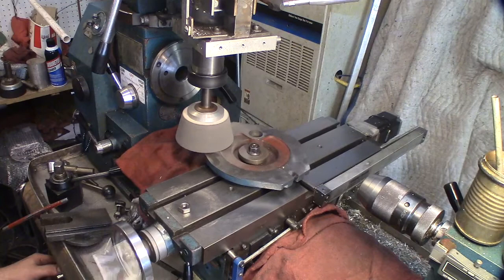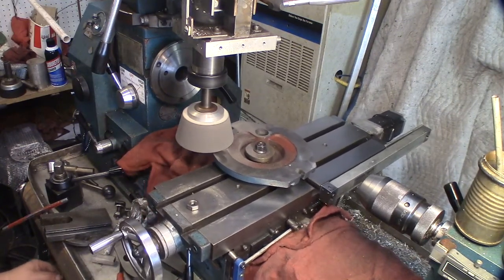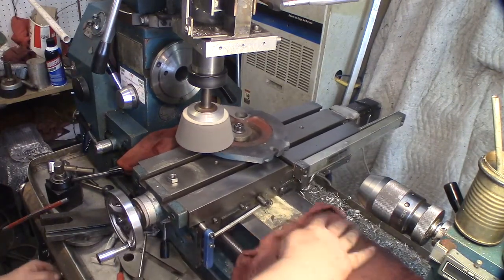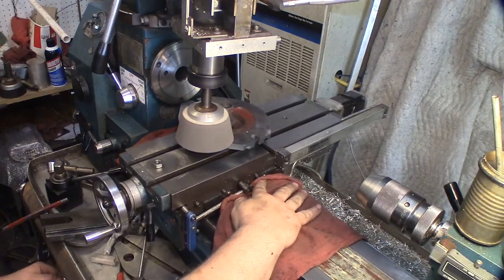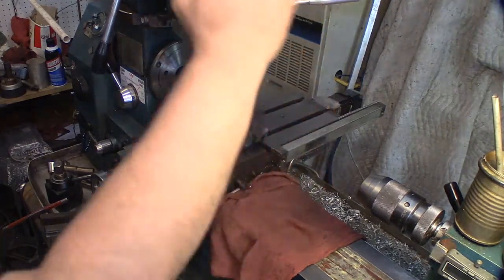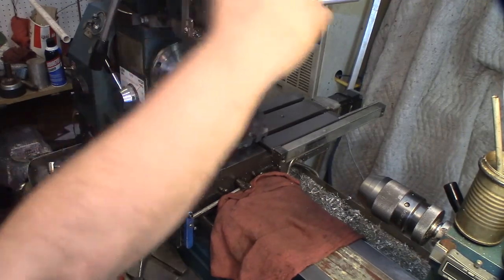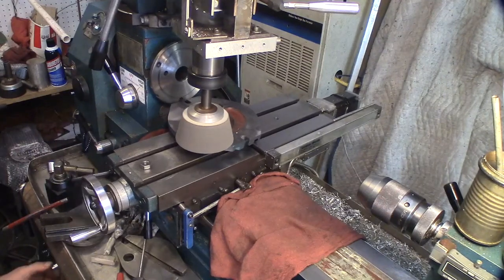Hello and welcome to Uncle Grouchy's Neighborhood. Uncle Cedric, if you're out there, bite me. I want to start a small project here to make an arbor. You can see on screen I've got an arbor using a cup-style grinding wheel, and for those of you who have done this kind of grinding, you know that by the time you get across the part, enough of the grinding wheel is worn away that you're not going to get a flat surface unless you're really just skimming it.